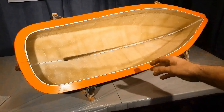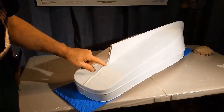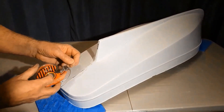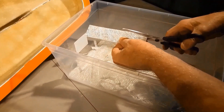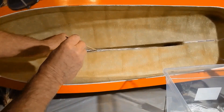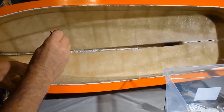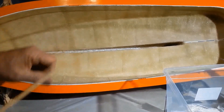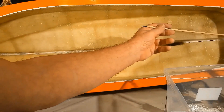My objective is to be able to remove the hull from these two molds in one piece, so I'm going to file this off right now. I'll use thin scotch tape and cover the seams, then put the hull back into the mold. We're going to cut some strips about 5/16ths of an inch wide from the scrap bucket, get these pieces, and lay them down into the joint area pressing them in. We'll go all the way along and make sure that there's one ounce mat covering every part of the joint.